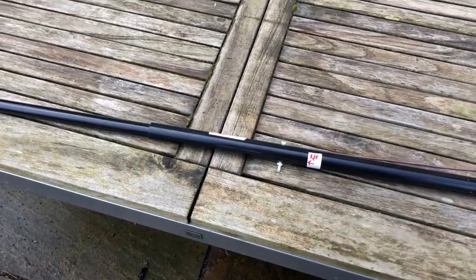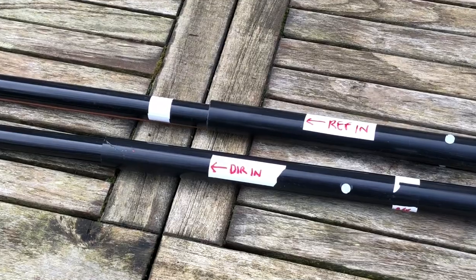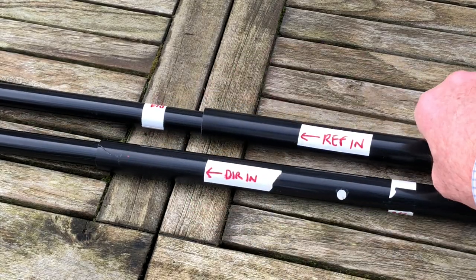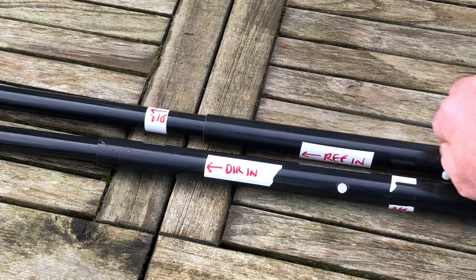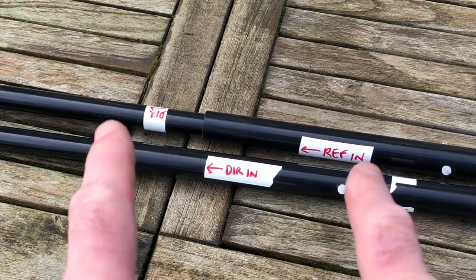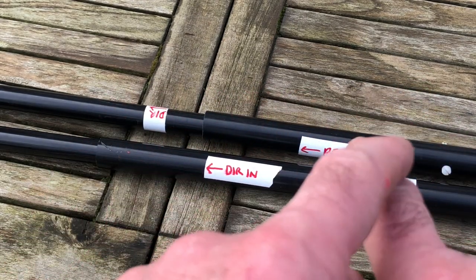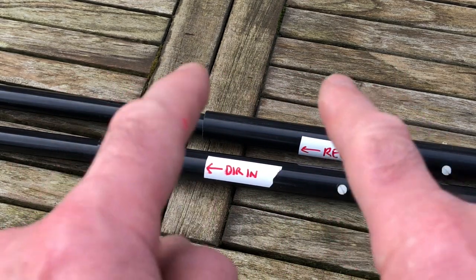And the same is on the director. I'll bring that in shot now. So here now you see them both in shot. That's the one we just looked at. Reflector in, so I know that goes into the stub mast, and that is the return point for the other wire. You can see there the director, when I tape it round, comes back to there. So if you think the front element goes a line across and back, one of them's permanently attached, you're going to run that round across, bring it back around the other arm, and then tape it on, so you've got that front element.